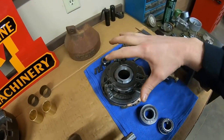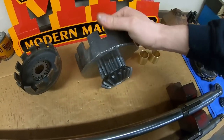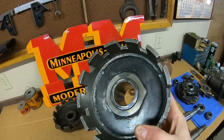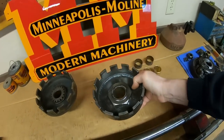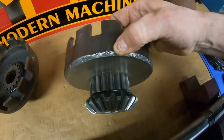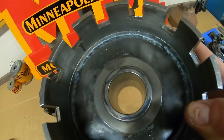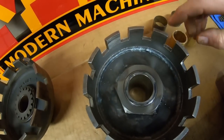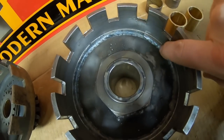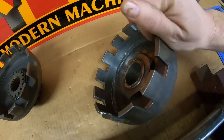Last episode we covered the clutch side in great detail, but we did not get much into the shell and the gears. This is the prototype one right here, and you can tell it's all handmade. The shell portion - this round part - you can tell they formed it by hand and cut all the notches in it. They welded it all the way around on the outside and inside, and that's actually a pretty nice looking weld. They had to true the inside in a lathe because they cut down into the weld right there, and it's just so finely finished.